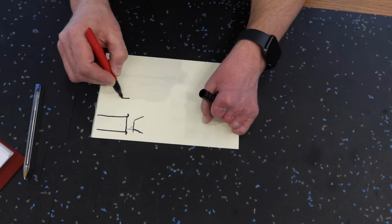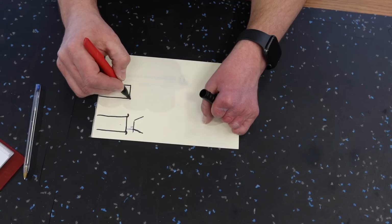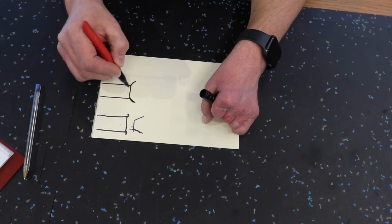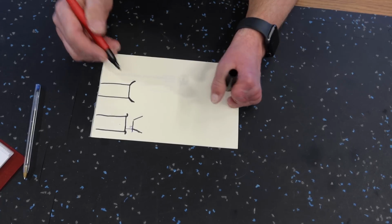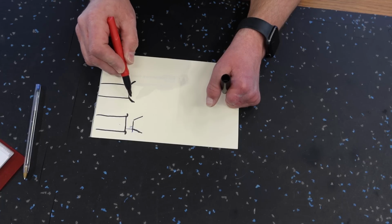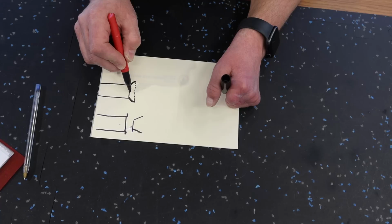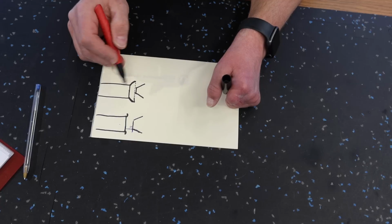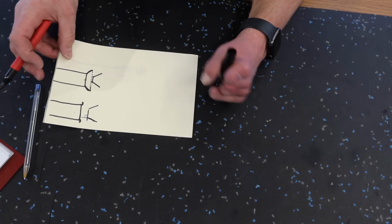Okay, scenario number two, you've got a pipe and you've got a little bit of a bigger bell mouth like this. Not very long. You know, maybe you've got a bell mouth kind of like this. You follow the same directions. So from this pipe right here, not the bell mouth end, which is right there, you go 25 to 30 millimeters to your exhaust cone. Don't measure that from the end of the bell mouth. You're always measuring from the pipe.